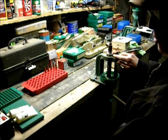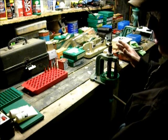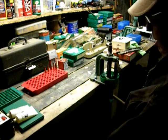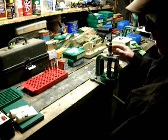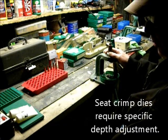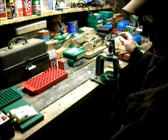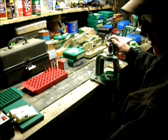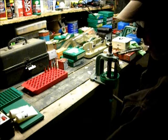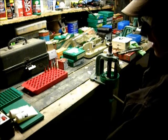There is a set screw and a piece of lead shot on the lock ring if you want to hold the preset depth that you have adjusted the die to. I do not bother with that — I adjust my dies to the top of the RAM stroke every time I use them. It is a different procedure with the bullet seating and crimping die, which is spaced about a quarter of an inch above the RAM at the top of its stroke. But the sizing die, if it is not a carbide sizer die, is brought against the shell holder before the RAM is at the top of its stroke.